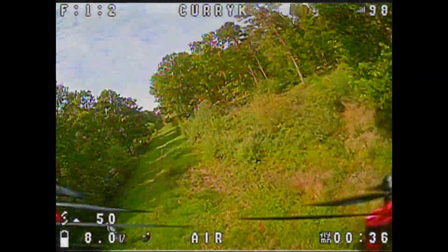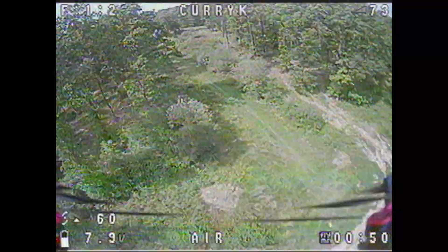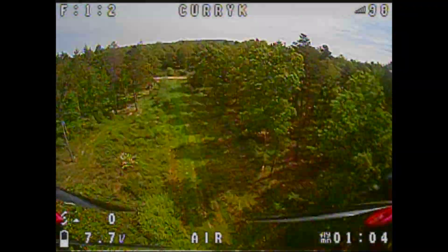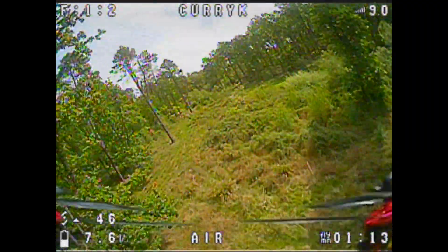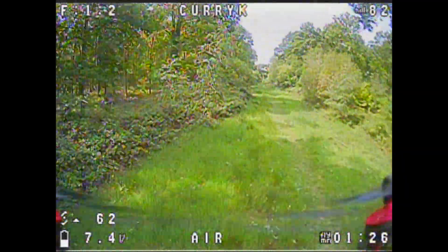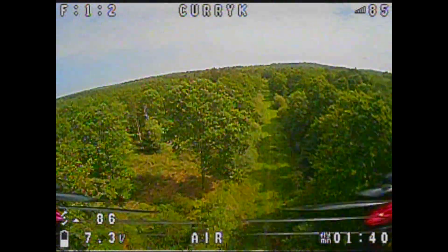I wanted to fly in 2S here, which I'm doing because somebody asked me in the comments - they said they thought 3S was a little bit much for the space they had and how was it in 2S? And the answer to that is very good. There's a little bit of top end power loss - you can feel it in the punch outs and when you are sort of trying to get max speed. Flying on a 3S high voltage battery gives a sort of crazy mental speed, whereas 2S is a bit more normal, so you don't really feel like you're losing much. It flies like a regular quad. I had a discussion with NDRC about this and he thought 2S was the way to go because you just could not get the power through on 3S - there's a lot of power that just does not get transferred through because the props go fluttering and you lose a lot of efficiency that way. But I'm happy to fly it 2S, though I like to fly it 3S for the pure madness of it all.